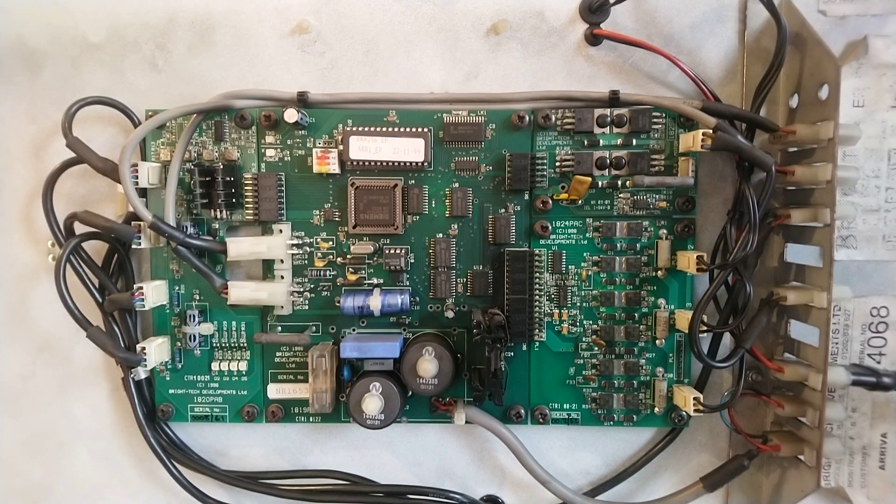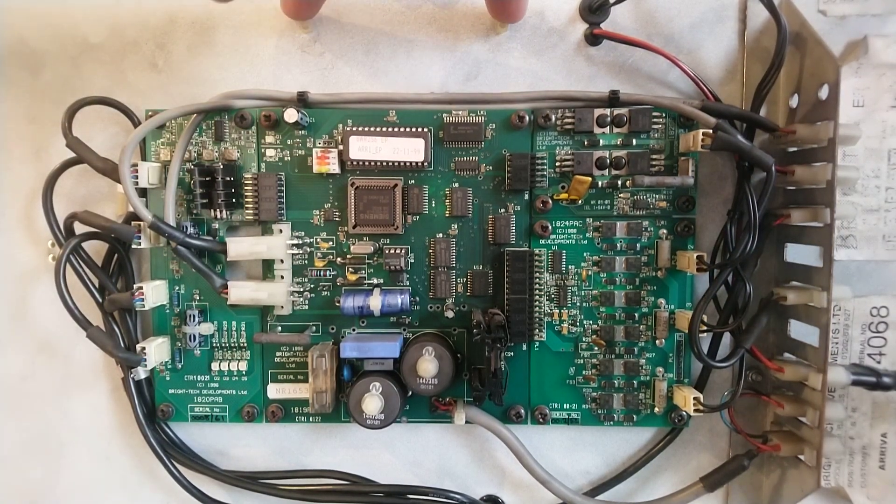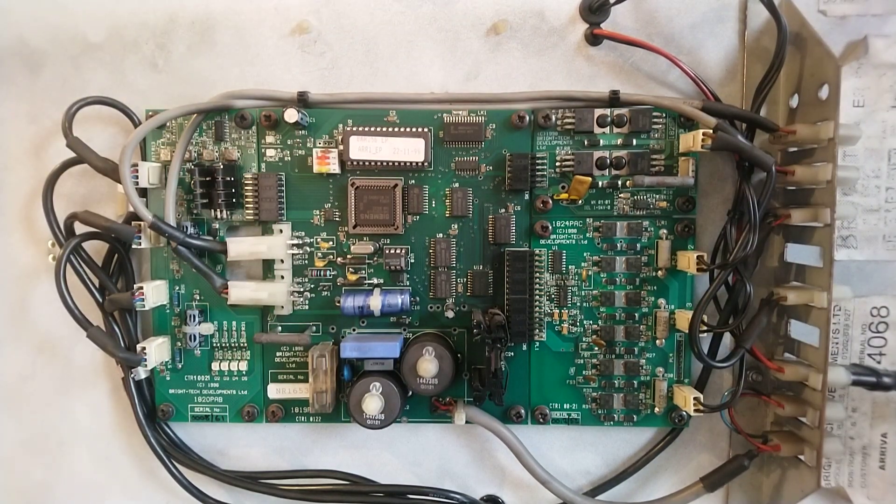This is the back of the display, and the reason why they couldn't fit the present light equipment inside is that it's fitted just here with my fingers at the very very top, on two plastic screws. This is the main motherboard that controls the entire destination. The other numbers box is just a slave — if this one goes wrong, nothing works.